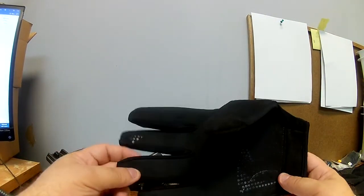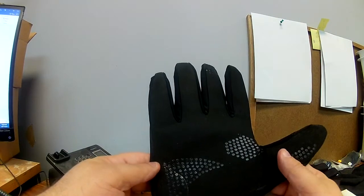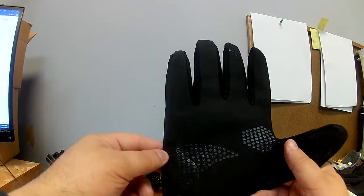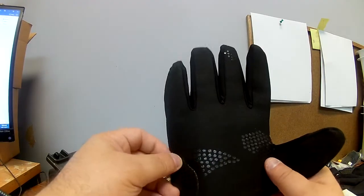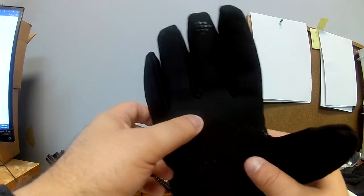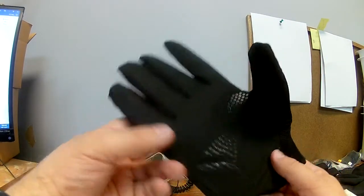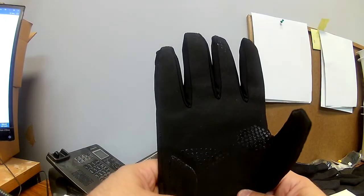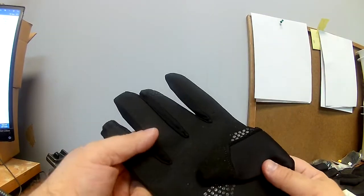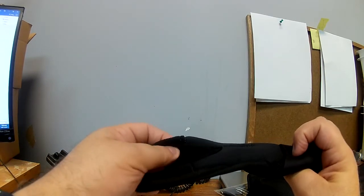Do you need puncture resistance? That's a question you should be asking yourself, but keeping in mind that with a puncture-resistant material, it's thicker, your dexterity is cut down, you don't have puncture resistance all over the glove. As I said, it's very, very important you know the limitations of your equipment, where your gloves protect and where they're not protected.